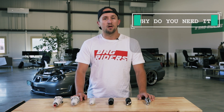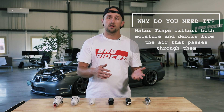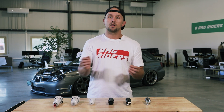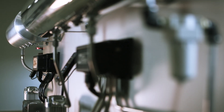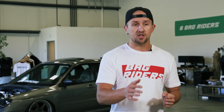Why do you need one? Water can be produced from an air compressor that's producing warm air. As that warm air cools down, it produces condensation, which is water. Water traps collect that moisture out of the air before it reaches components in your air system like your manifold. If moisture gets in your manifold, that can cause issues such as valves freezing in cold climates or damaging electronic components like pressure sensors.